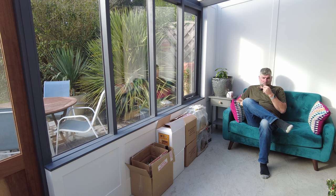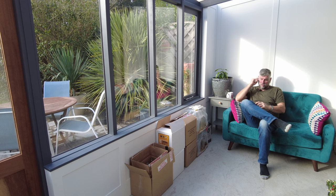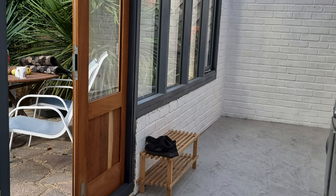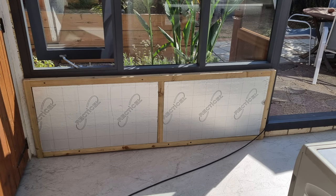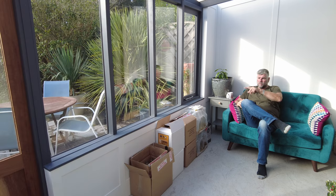The double glazing is all in now — that's all lovely. The panel work and the sill down here — behind all this is brickwork. We put 40mm Celotex insulation all the way around in a 2x2 frame that was bolted to the brickwork. The Celotex went in really tight, making it thermally efficient. Thermal efficiency is fantastic.